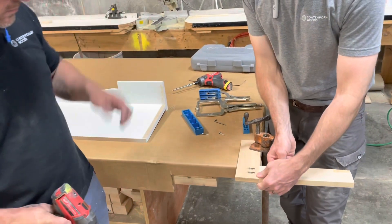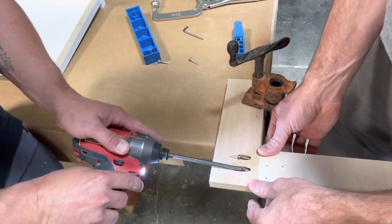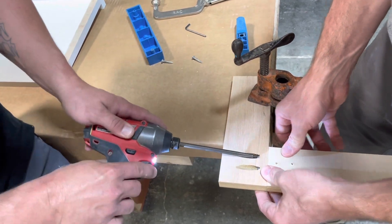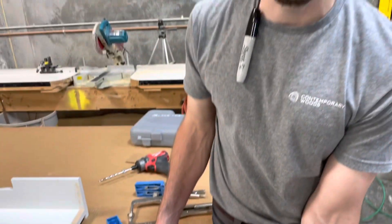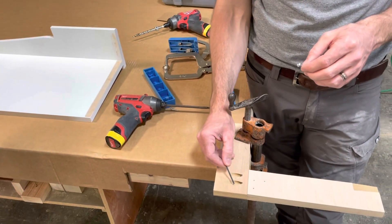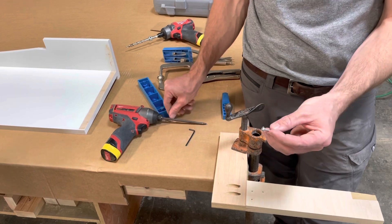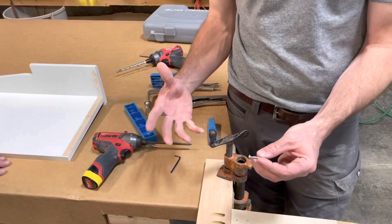If you do edge screwing like this — go ahead and screw it — when you're putting a face frame together, that screw is not going to go through the surface. So to recap — we're showing the proper oblong hole. This is the kind of hole we want, we don't want the incomplete oval. We're also showing when to use a one-inch pocket hole screw and when to use the inch-and-a-quarter pocket hole screw. Thanks for watching.